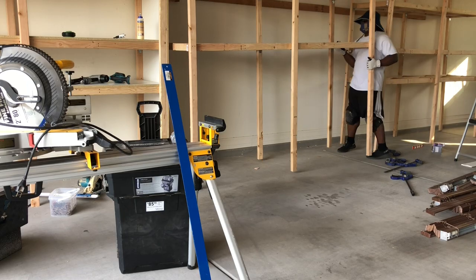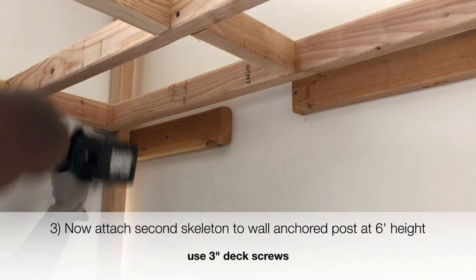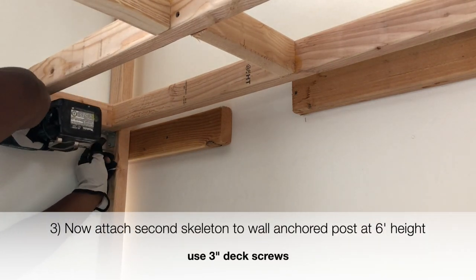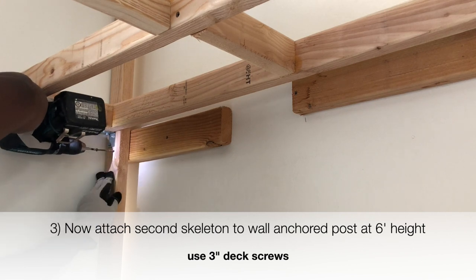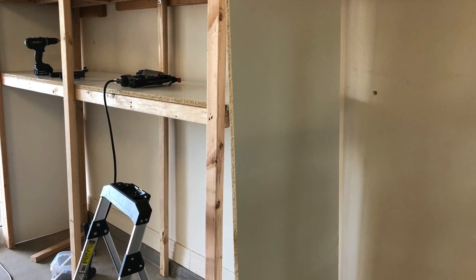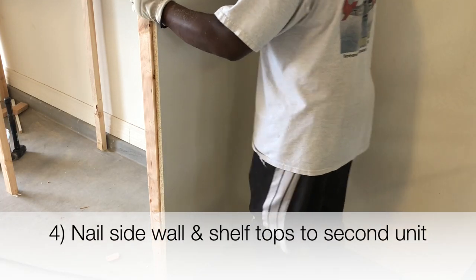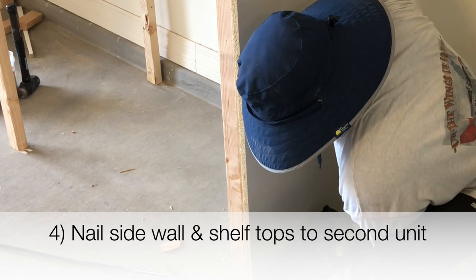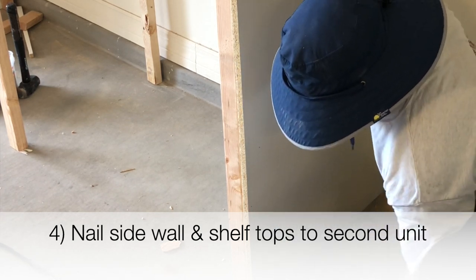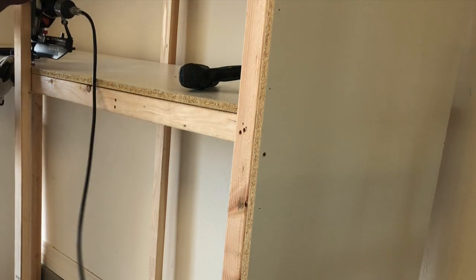Tack the sidewall on, then put the second skeleton back in place and attach it. You're going to screw and secure it to the horizontal posts on the walls with three-inch deck screws, and just continue that down. Once you have your melamine boards located where you want them, grab your nail gun and start to nail all around the unit, attaching that melamine board to the skeleton.